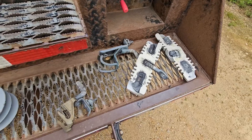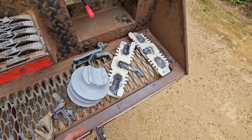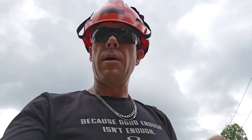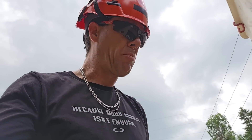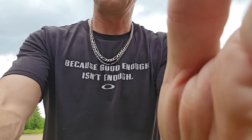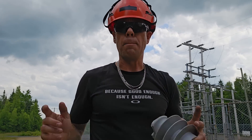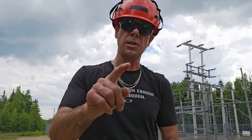So it's not that plastic or porcelain is any better than the other — they both have their advantages and disadvantages. But be careful around porcelain switches: anytime you're operating a switch of any kind, make sure to take a good look at it. That's what causes a pole to burst into flames — when an insulator is breaking down. I'm going to jump back in the truck. I appreciate you guys stopping by and hopefully in the near future I'll have a chance to do a lot more editing. I appreciate you guys as always, and we'll see y'all soon.